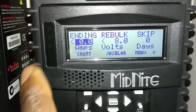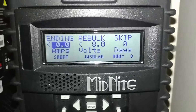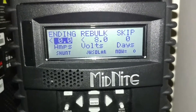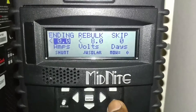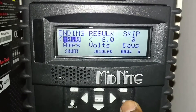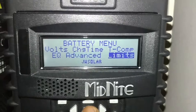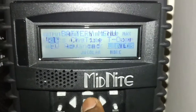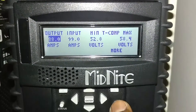For your ending amps value, some people go with 0.6 or whatever — go with your battery manufacturer's specification. Set the system up right and it's going to work. Your limits setting will still stay the same; for me it's 88, because of the 48-volt system.